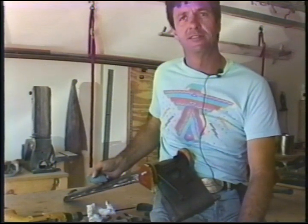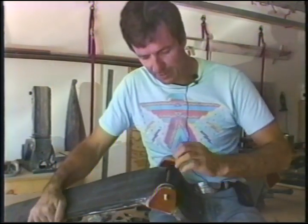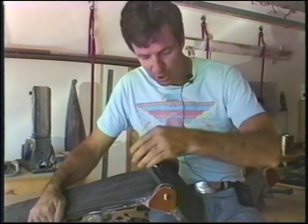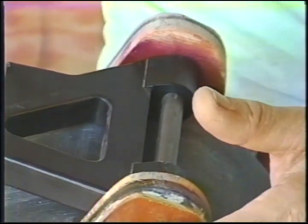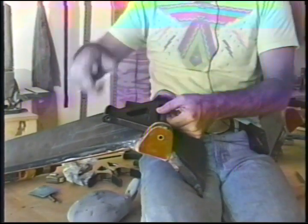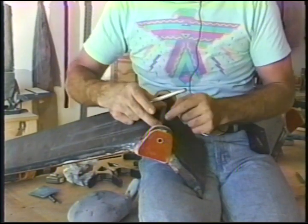Flox underneath. The first thing we're going to do, after we've done all this sanding, is sand this bushing carefully and just put a cursory layer of flox underneath, just enough to make sure that it sits still and hardens in place. When it's in place and the resin's 80 or so percent cured, then zip, we pull this bolt out of here, leaving the bushing floating in space, and we're going to pot flox from this surface down to this surface in both directions.